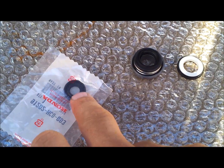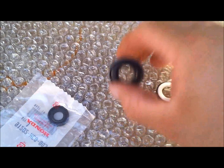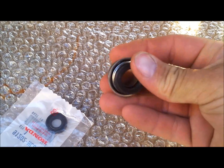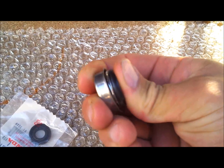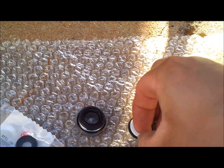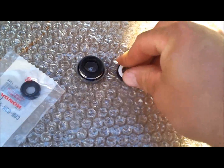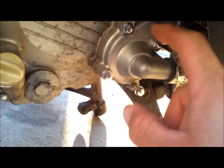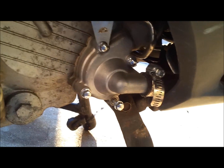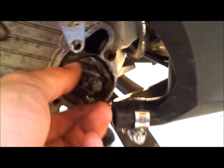What we're going to replace in there are these little parts: you've got your actual oil seal that separates the oil side from the water side of what's inside the shaft. Outside that you've got a little metal cap that's spring-loaded, with a spring-loaded gasket. Then outside that there's a little nylon washer that sits inside a rubber gasket. All those things get layered up inside there behind the impeller.